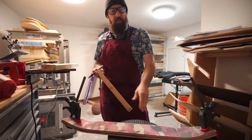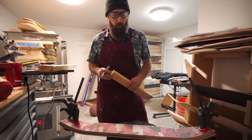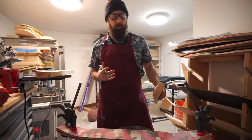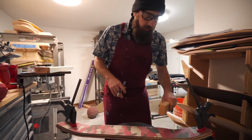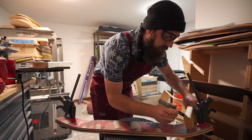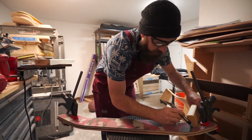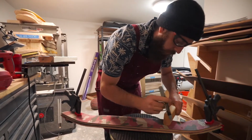Once we've got our 6-inch spacing, we're gonna template out the slots that we're gonna put in for our boards. I've found that it holds boards a lot nicer if you do this step at an angle. And so we're gonna use this little piece of wood as our template, and I'm gonna set it right over that first slot, and we're gonna simply trace around this 2x4. And we're gonna do that all the way down our board.